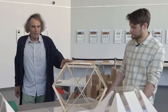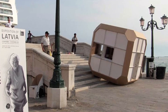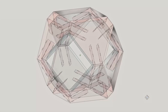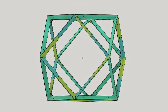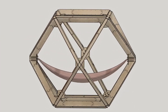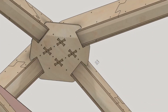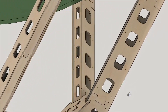These were challenging guidelines to fulfill for a plywood frame that would be 2.6 meters in height and could be rolled around on different surfaces. The size of the object and the unusual functionality made me anxious — I wasn't sure how I would make a frame that wouldn't break after rolling it more than a thousand times. I designed multiple variations and narrowed them down to one simple yet sturdy design. The only problem was weight: according to my calculations it would weigh around 116 kilograms. So I made some cuts in the design and got the weight down to around 90 kilograms, which was great since the original cardboard dice weighed around 70 kilograms.